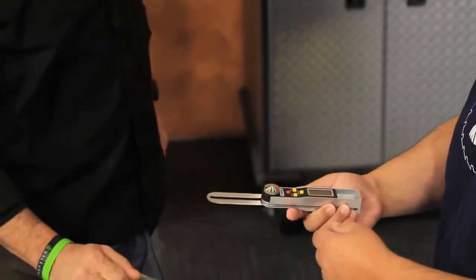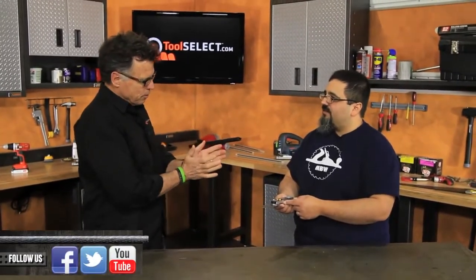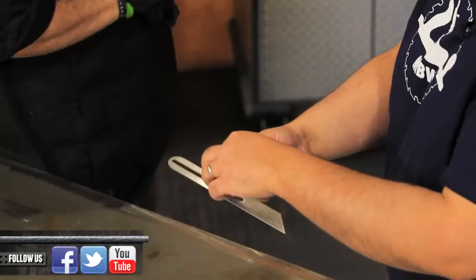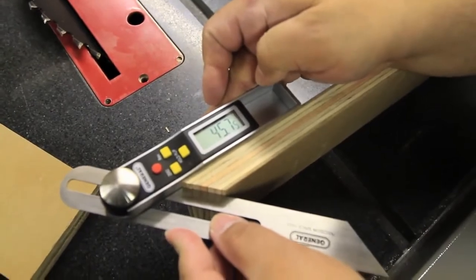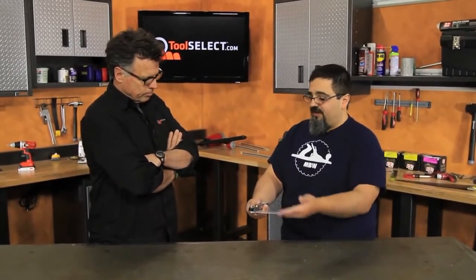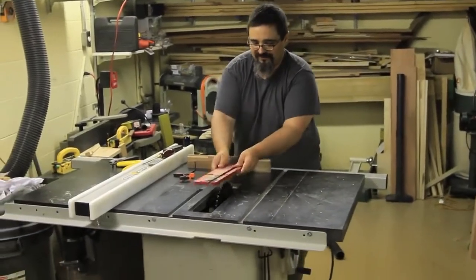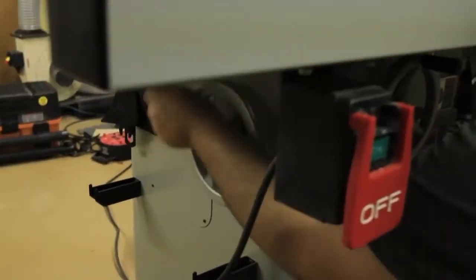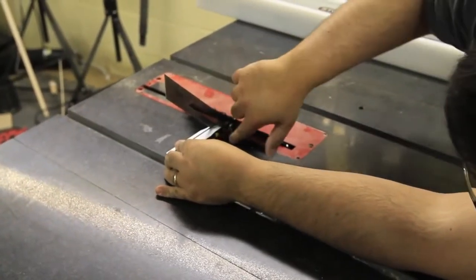You probably have a T-bevel in your back pocket most of the day. There's been a few times, yeah. But this one is digital, so first let's talk about what you used it for. Typically when I'm using a T-bevel, I'm transferring an angle — say my wife found a piece of furniture she likes and we want to rebuild more of them. Another use might be transferring dovetail angles. And once in a while I get pulled into carpentry work, where I take those angles and transfer them to my saw for tight molding fits.